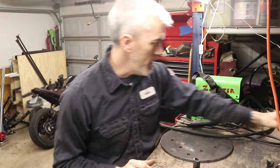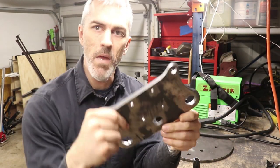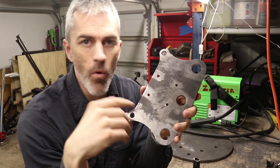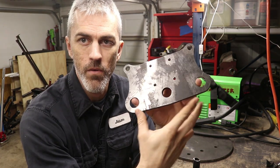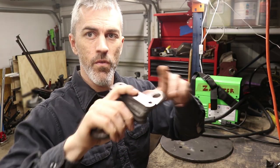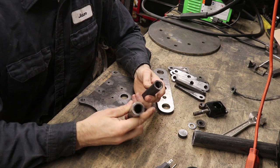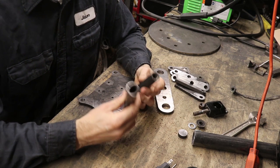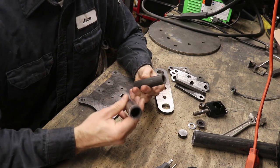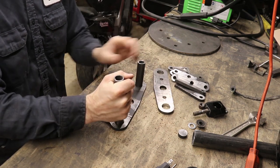Here are my pieces that I had cut out. Here's sort of the main one — the coolest, biggest one. You can see the steering side right here and then we've got the two sort of fork legs right there. All of this stuff — same stuff I used for the frame for the rear wheel. The wishbones on the rear wheel, I'm using the same tubing for the front wheel. Logically, that makes sense to me in terms of strength. I use 120-wall, one-inch tube.